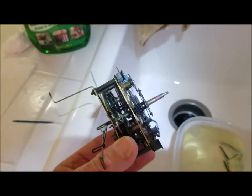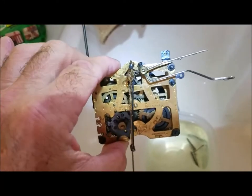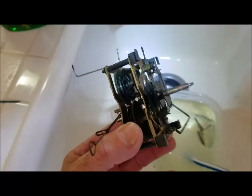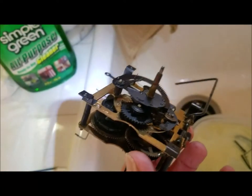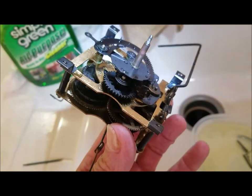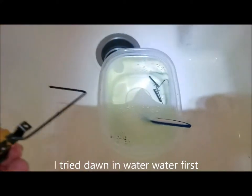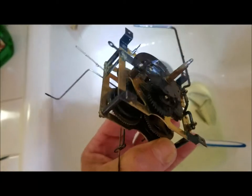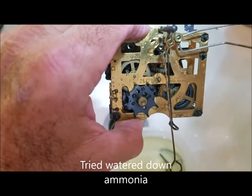All right, I know this isn't the proper cleaning, but this mechanism came out of that music box cuckoo clock I got out there that was so gummed up. It looked like it had green pancake syrup in it. You can still see some up in there. I'm just taking a toothpick. I tried Simple Green, and I just put ammonia in here. I've got some of the parts out of here, but I don't really want to disassemble the whole thing, so I've just been pretty much cleaning it